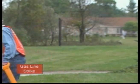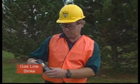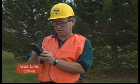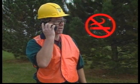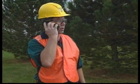Now you must evacuate and secure the area. And then call 911 or other local emergency number and contact the appropriate utility. Do not smoke or do anything that may cause a spark. Finally, do not resume boring until you have been cleared to do so by the appropriate utility.